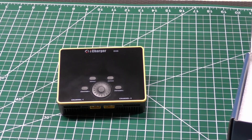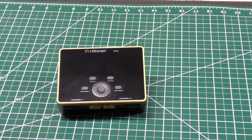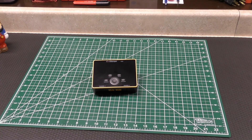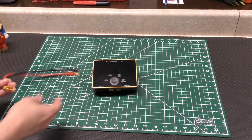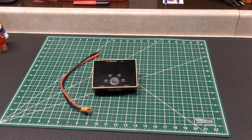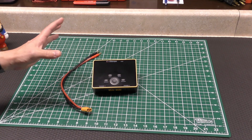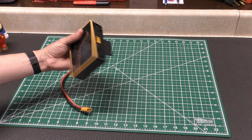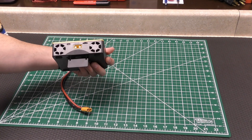What I want to stress here is, now that the unboxing is technically done, you're probably not going to be able to use this charger if this is all you buy. I had to read up on this and realize what I was getting. I want to stress in this video that you will have to go out and also buy this as well. To power this thing — this is a DC charger, not an AC/DC charger. So the input is an XT-90, and I guess you would call it male because the actual pins are in there.